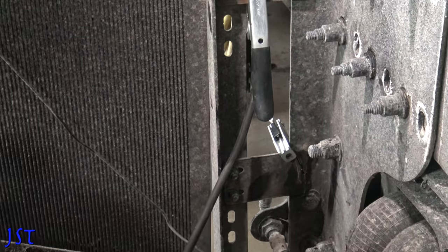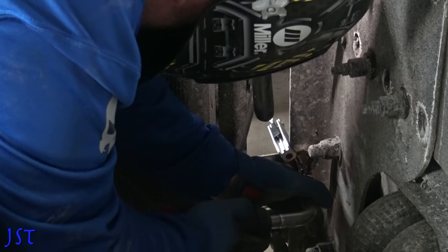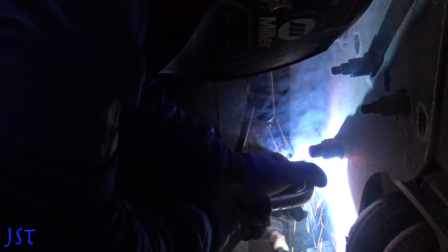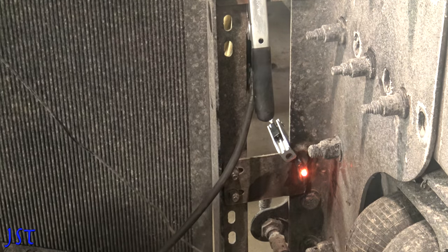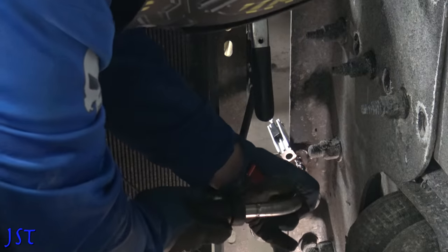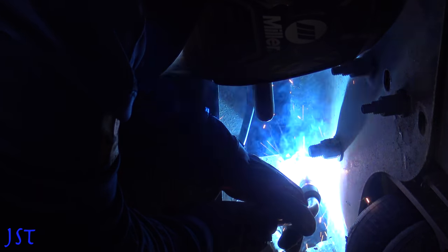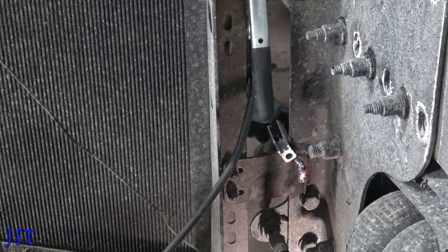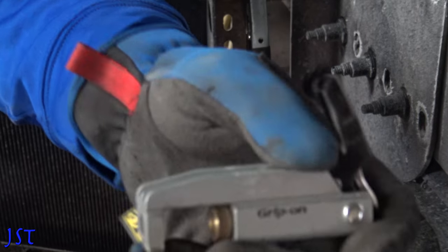Working around all these lift axles and shit, it sucks. All right, let's see if we can start laying some dimes here. All right, that looks like shit because we're a little too hot. Let's move it down. We moved it down to 1/8 inch. All right, that's where we want to be — 1/8 inch. I was just using one of these little grip-on clamps; these things work pretty cool.